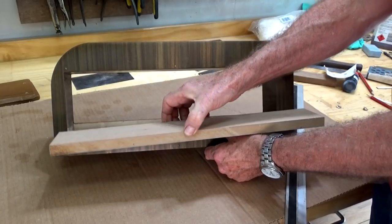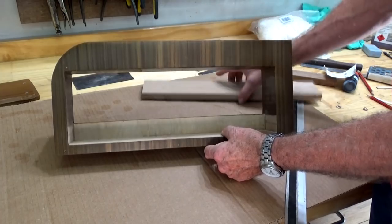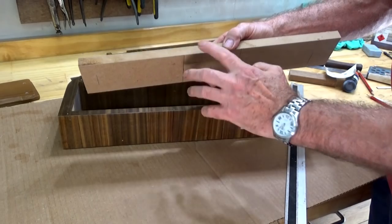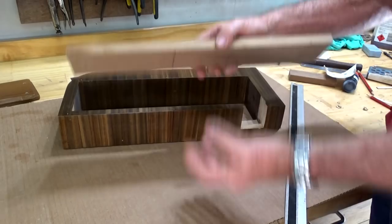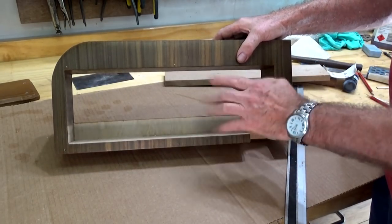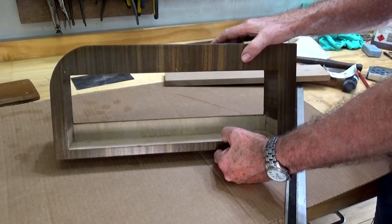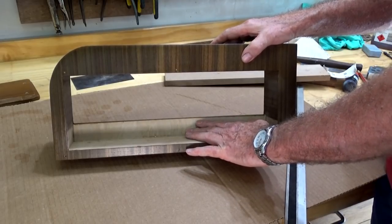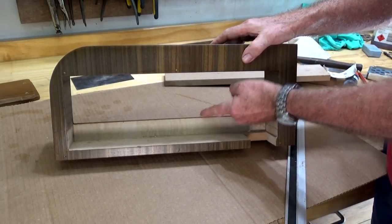So there's a piece of MDF board, and that deep section there is basically made up from the cross section of this MDF. Now, you will know what happens if this stuff gets moisture on it. It just expands, sometimes almost double its thickness. And that's precisely what's happened here. Now, the weather where I'm working at the moment has been hot and humid. We've had a lot of rain, and this has obviously absorbed a lot of moisture over the last couple of days. And it's caused this to expand vertically.